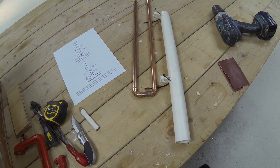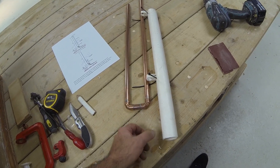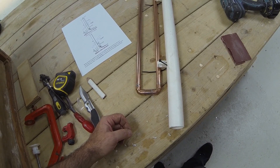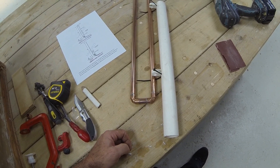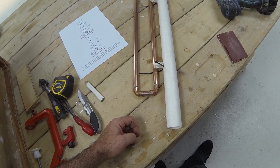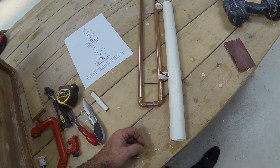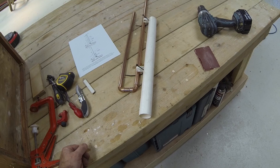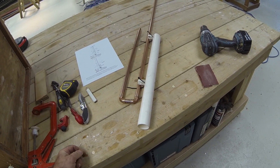That's about the ins and outs of the build. Some tube, a few fittings, all made out of off cuts and scrap really — a bit of plastic, couple of pipe clips, couple of cable ties — and that's the physical part, good to go. I just need to connect my coax down around about here somewhere, and check how it resonates and the SWR. We can just adjust that by the length and where the coax terminates on the end. Very simple, nice little weekend afternoon project, and thanks to M0UKD for his online calculator — you should check it out. See you in the next video when I'll put it up the mast, see how it tunes, how it performs, put some CQs out and see what we get.